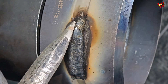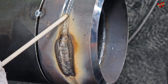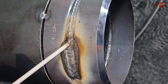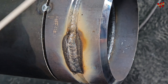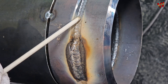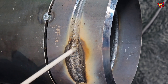It burns rod perfectly, even at low amps. Now if you're doing overhead and trying to control amps with one hand, that's brutally hard — for beginners, damn near impossible. Crank the amps up and the puddle drips on you. That's why this machine has a hot start function. Hot start blasts high current right at the beginning — set at 100, it kicks off at 150 — which stabilizes the arc fast and pushes the slag out.